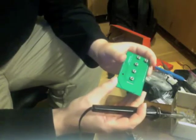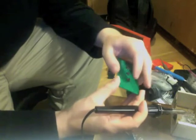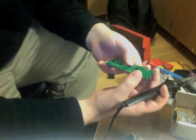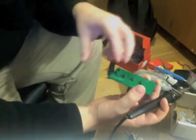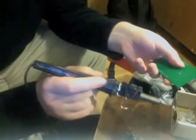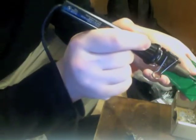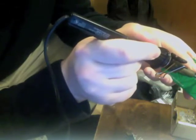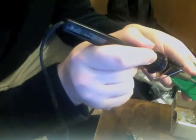The thing you want to remember when you are soldering these buttons is you want to push on them from the other side to make sure that they are fully seated in the holes, because they have a tendency to kind of back out. So as I solder this I am going to push on it from the top side while I solder it on the bottom side. You want to apply the heat right to where you are making the joint and then just tap a little bit of solder on there.